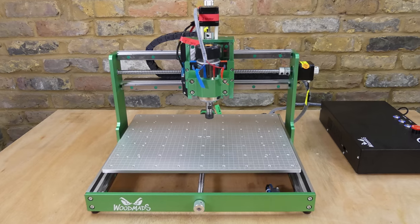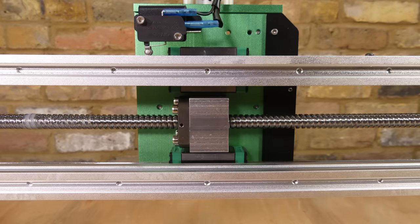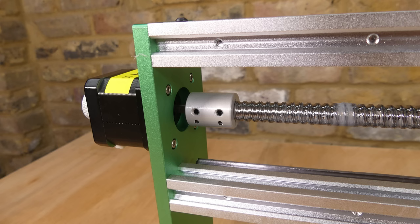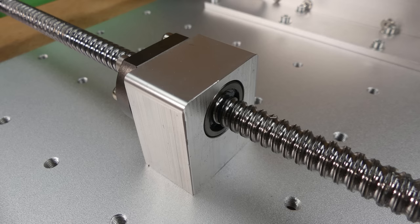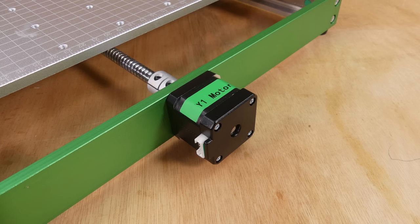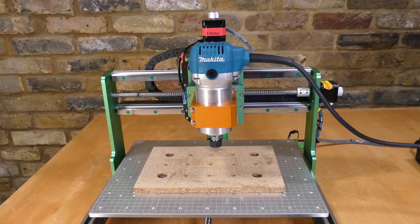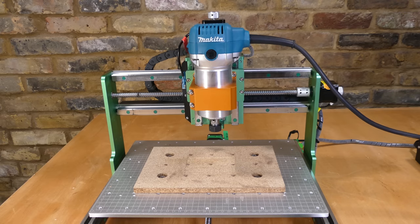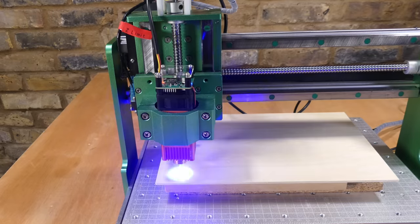So I think that this is an excellent little desktop CNC machine. It features linear rails and ball screws which helps to give the machine good rigidity and accuracy, both of which are important when milling aluminium. To get the best out of the machine it would benefit from a more powerful spindle motor — the obvious choices are a Makita trim router or a 65mm VFD spindle motor, which I'll be testing in a future video.